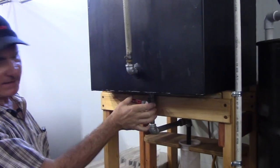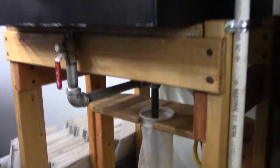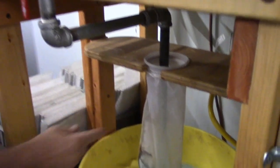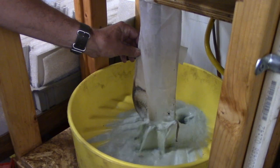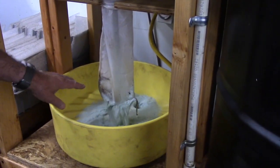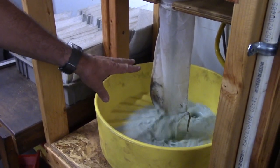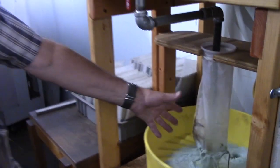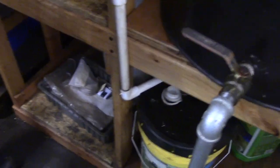The next step is you open this valve and the coolant starts draining. It goes through a 100-micron filter — and I just have to say, that's really, really small, not very much gets through there. So if there are any contaminants from sitting out in the open, they'll all get filtered out. It then goes into another bucket down here.